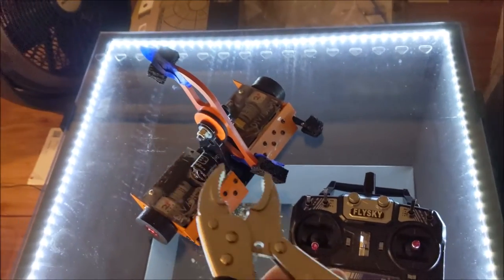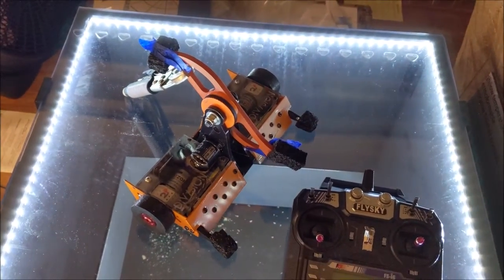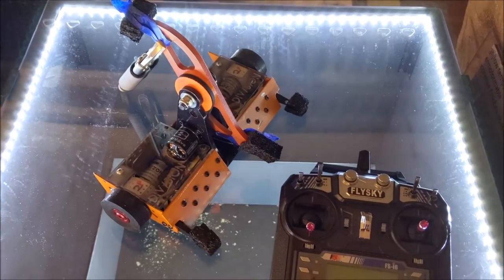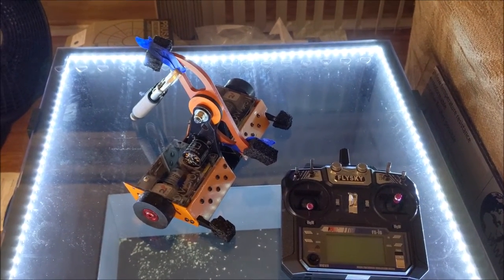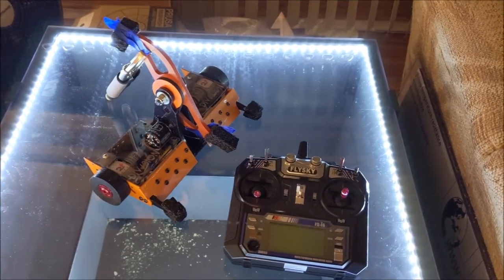For any kind of kinetic energy spinner, you will need some kind of a weapon lock. This is very frequently something just as simple as a vice grip. Oftentimes for weapons that are a little more compact, you can stick a pin through — like through a hole in the upright through the weapon. That's acceptable as long as it's very clear that it can stop the weapon from spinning up even if the motor were powered. It shouldn't be capable of spinning up and the weapon lock should not fly off potentially injuring anyone. So make sure your vice grip is actually on there tightly enough.